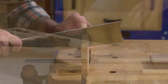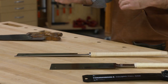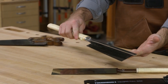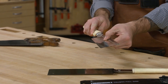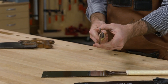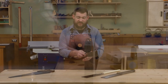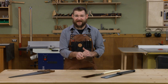These come in a couple of different styles. The first is called a Dozuki. This has a back on it that helps reinforce the blade, and the blades are extremely thin. This is my go-to saw for cutting joinery — I love to cut dovetails or tenons with this. It's a really nice narrow kerf and it's extremely easy to line up.